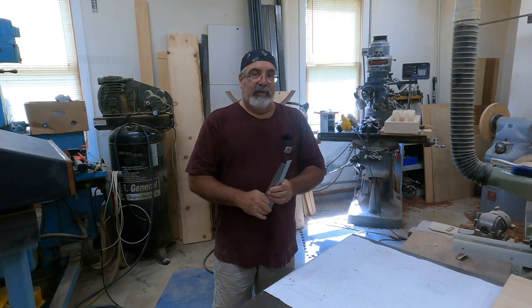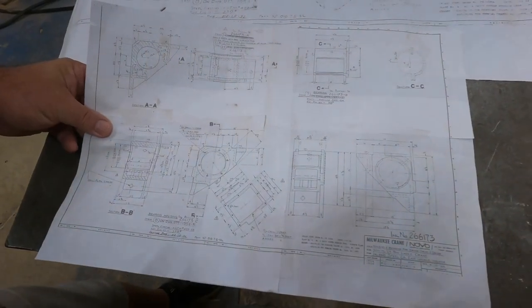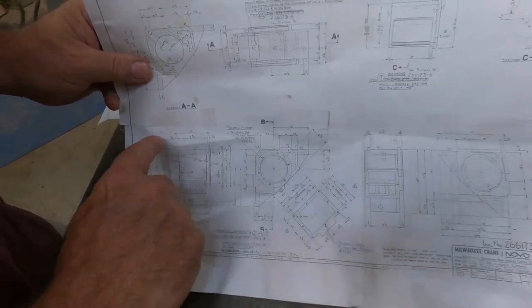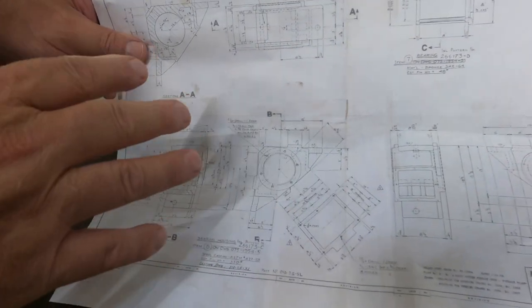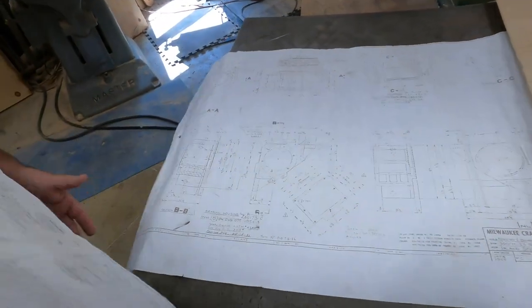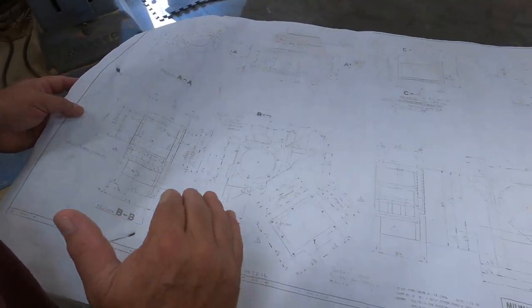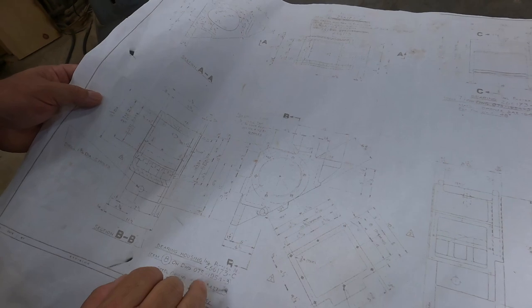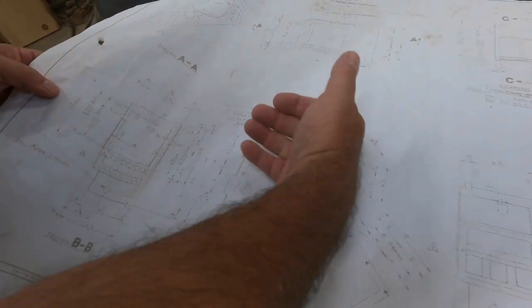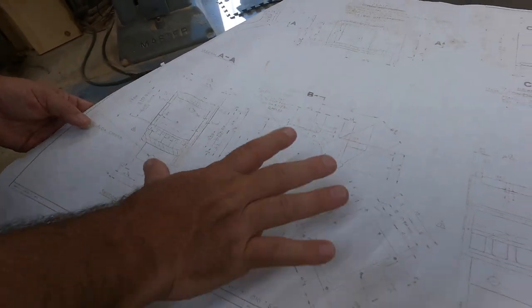Let me take you down and show you the drawing and the layout. So originally I got this drawing here — it's all taped together and it's really small, so I can barely read it. I took it over to Staples and we came up with this bigger drawing here, which is the exact same thing only larger. In most drawings you have at least three views: a top view, a side view — this actually is a bottom view — and what's called a section view. You can see 'BB section' — it's like taking a saw, cutting along this line, and then looking at it from that direction.